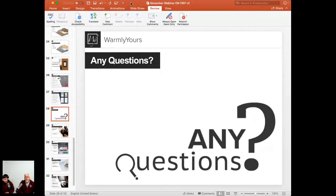So the first question, when I started here a decade ago, is people would ask, can I use this type of product? Well, a decade ago, a lot of people didn't know what the R values of floorings were. So you'd have a manufacturer go, well, we don't know what the R value of that is. But if we saw a pre-attached pad, that was a bad signal because a pre-attached pad is foam. Foam contains air. Air is a good insulator. So we would always say, stay away from the pre-attached pad.